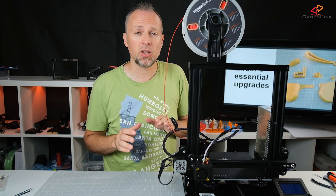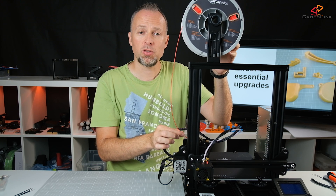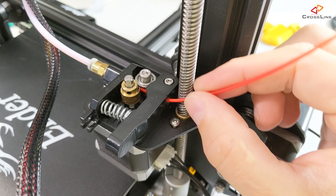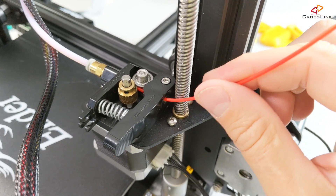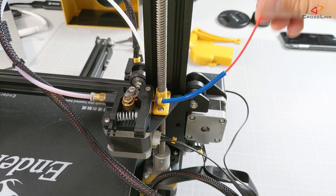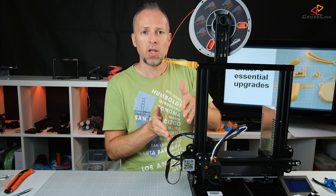Now let's look at how the filament is routed into the extruder. If you look at the default filament spool setup, the way the extruder pulls filament down from the top spool can create a pretty small bending radius, causing it to rub against the plastic parts of the extruder and wear them over time. Additionally, the filament runs very close to the Z-axis lead screw and can rub against it, resulting in filament dust landing in the lead screw and potentially blocking it from moving. This upgrade just needs a small piece of PTFE tube costing less than one dollar per meter, helping guide the filament away from the lead screw with a much better bending radius. You can also print a filament guide that helps guide the filament down to the extruder at a much better angle.